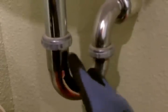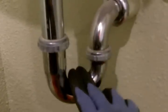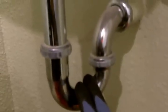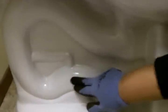The other thing the trap does is sometimes there's a blockage in there, and it makes it easier to remove the trap and clean out the blockage — sometimes it's soap scum, sometimes it's hair. Same thing with the toilet: you're generally going to have your blockage right in the trap. This is toilet augering 101. So we're back at the toilet — this is your trap right here, there's water right here, and that's preventing gas from the sewer from escaping into the house. Chances are, that's where your blockage is too. You get there with the toilet auger, and that auger's got to go all the way around to get to the blockage.